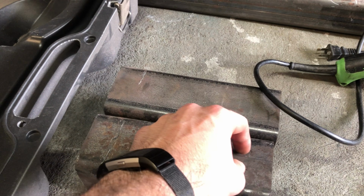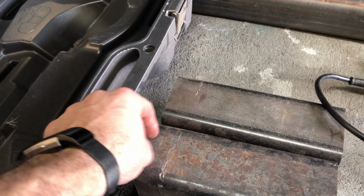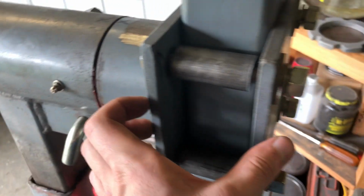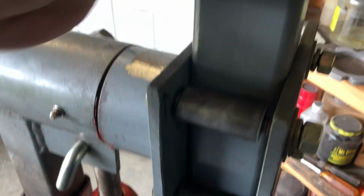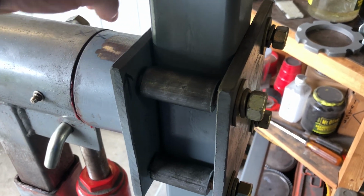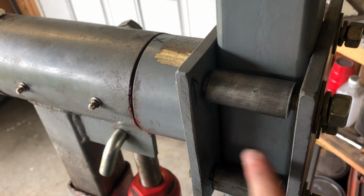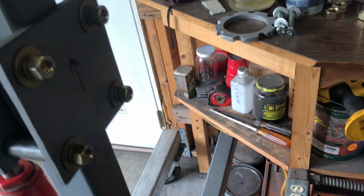So I'll seam this down all the way down it. The back side and front side, I will attach here. Actually, I only need to use one. I don't need a front side. I just need the back side to keep this from shimming back and forth. So essentially, it'll sleeve in like this, and I will weld the top, sides, bottom, and I may even drill 2 holes in the back and plug weld just for added measure.